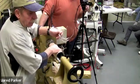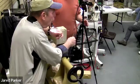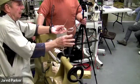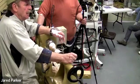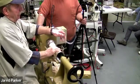When you get into the lower, even the one that I passed around there, the holly, it's a little bit softer. Don't get me wrong, it turns beautifully, and with a nice sharp tool you can get on there, probably 320 grit, maybe 400 if you're really good, and it's beautiful wood, but it's much softer than this right here.